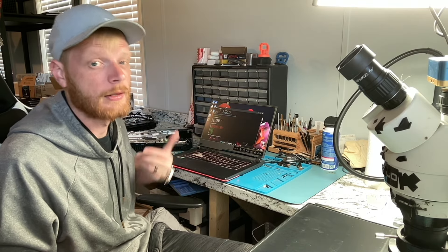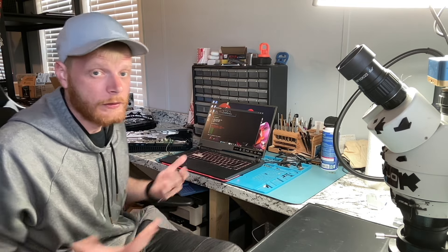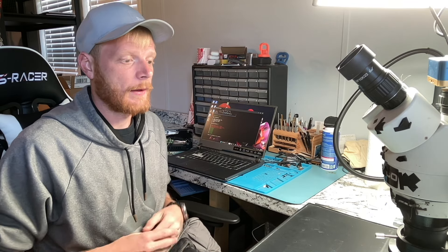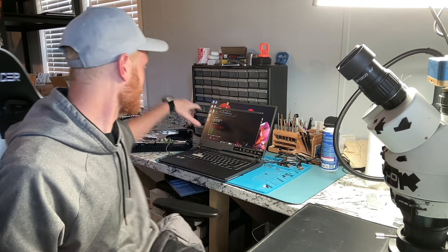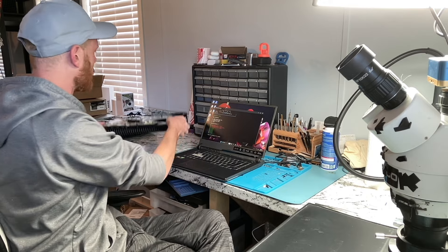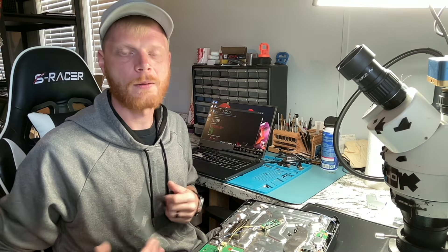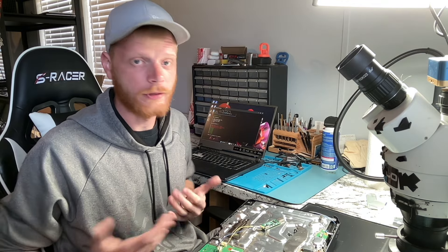That's really it — that's how you use this tool. It's very simple and straightforward, and it's going to make your life easier. I worked on one recently that had a bad HDMI encoder — it would respond to the power button, even the eject button, but no LED and no video, so it wasn't fully turning on. What made me fall in love with this tool was that I was able to take the PS5 apart to this minimal level, solder three points, connect the tool, and it told me 'Your HDMI encoder is bad.' Perfect — I can call my client and quote them accordingly without disassembling the whole console.